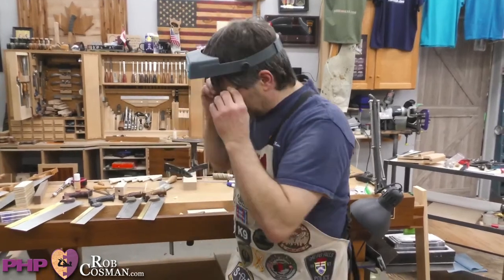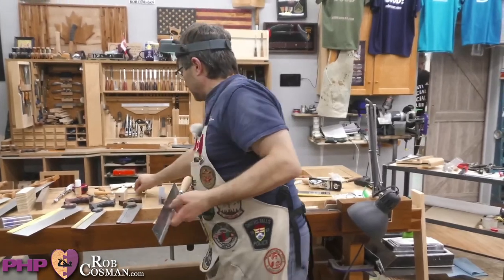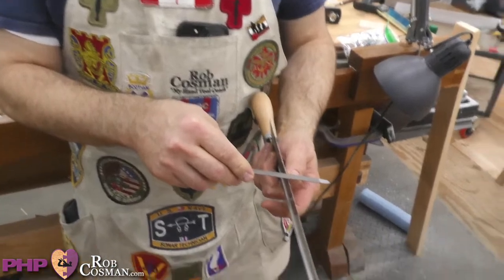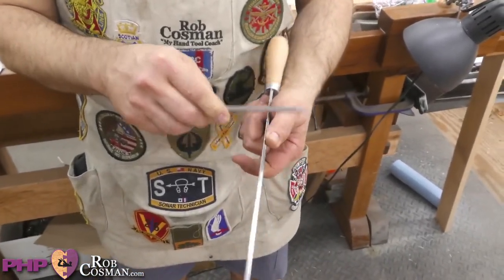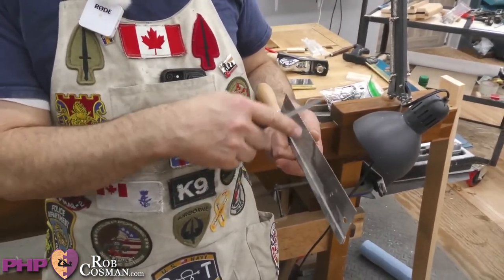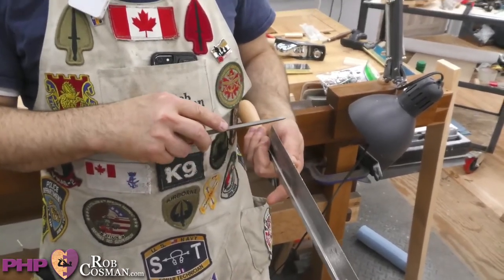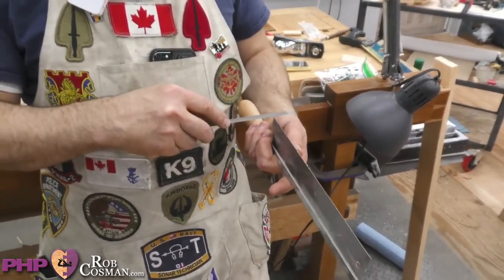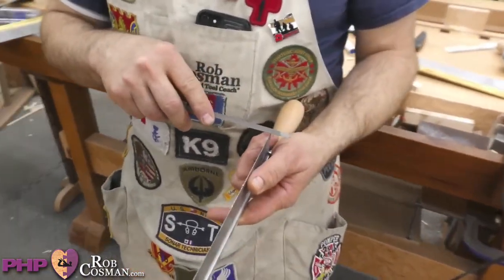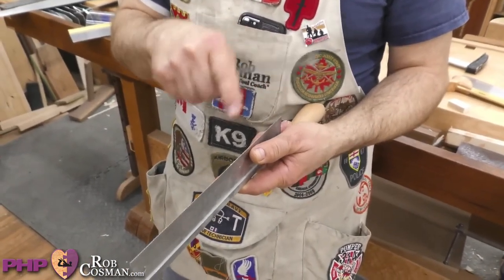The teeth on your crosscut saw have what we call fleam, so the tooth is going to be angled like that, 30 degrees. The rake angle is going to be 15 degrees. So you're going to have to file straight across like that. I mean, you can do it. You've already got your spacing, but you're going to have your file so that your cutting face is more like 0 degrees, and you got to file through a fair bit of metal in order to get rid of that existing angle that was on there.